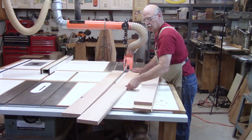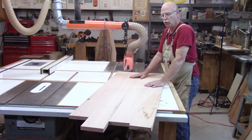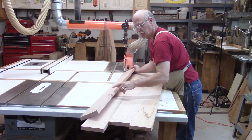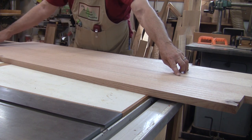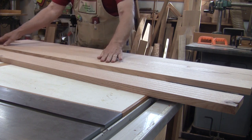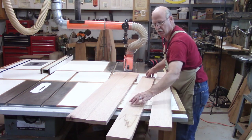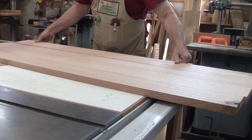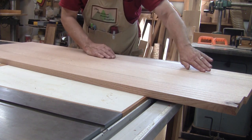Now that I've got all the boards to dimension, I need to lay them out and get the best grain. We need to spend a little bit of time to get the grain to match the best. I have plenty of width so I can cut out some of the defects. I see a knot here which I will cut out. I've got some black stuff here I don't like, so I want to cut that out. You need to look at both sides of the board — I don't like this fungus on there at all. I think it'll work like that because the ironing board shape will come in and I can cut that out as waste.